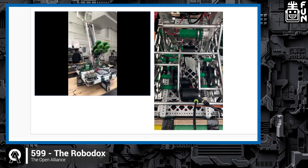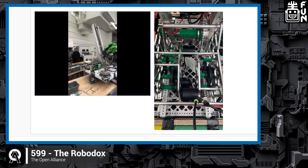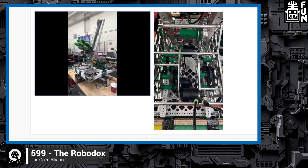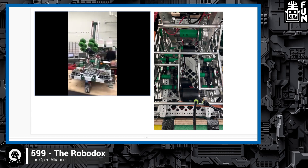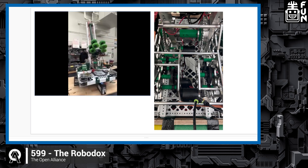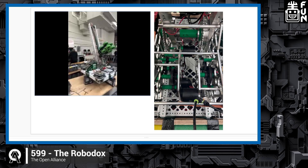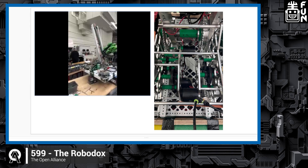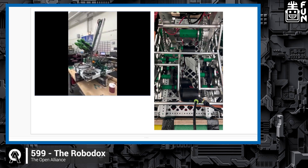Here's a quick video of the robot right after finishing basic assembly. At the current moment, the arm and intake don't work because of some issues during CAD. They originally planned to use a cable drive for the wrist on the intake, but realized the pulley would not rotate far enough, so they're currently switching to belt. The inside of the gearbox has five NEOs — two powering each joint, and one powering the end effector.